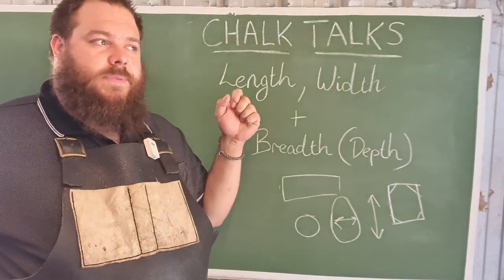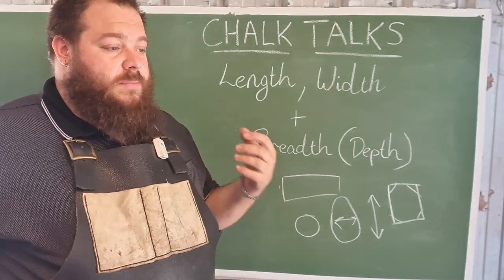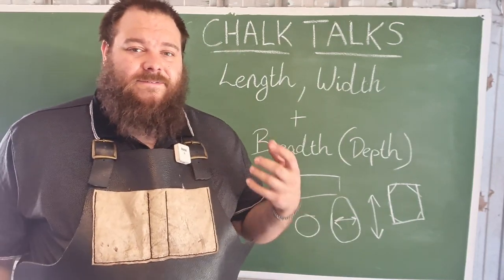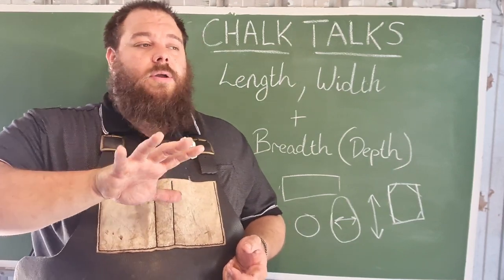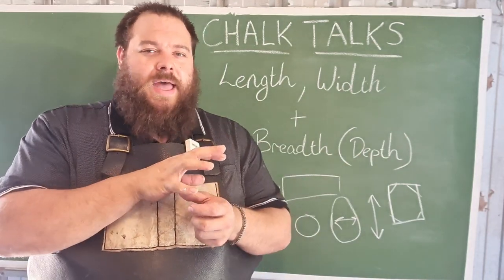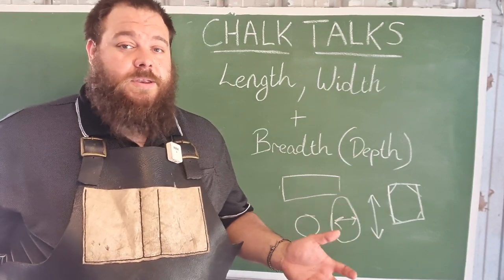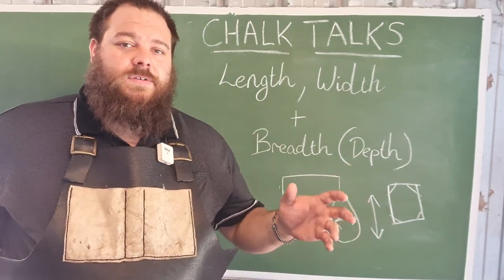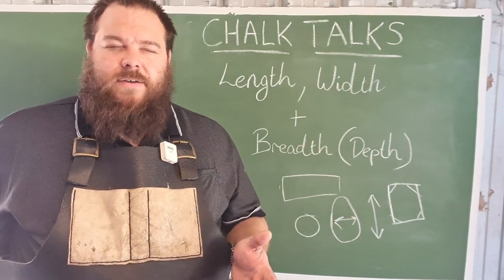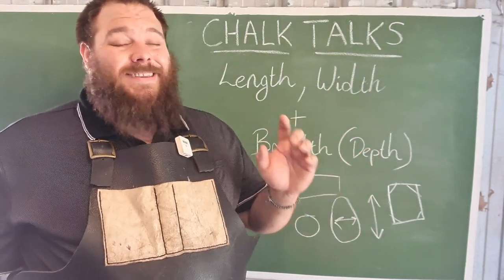When it comes to length, there is such a thing as too long and too short a handle. For most of the knives that I make, my handles are between four and a half and five inches long — that fits the majority of hands. My hand is one of the largest I know and I fit a five inch handle quite comfortably. At four and a half, my pinky is right on the edge of the pommel, so I'll want a slightly larger handle. But for the majority of users, anywhere between four and a half and five inches — about 112.5 to 125mm — is about right, and that doesn't matter the size of the blade.